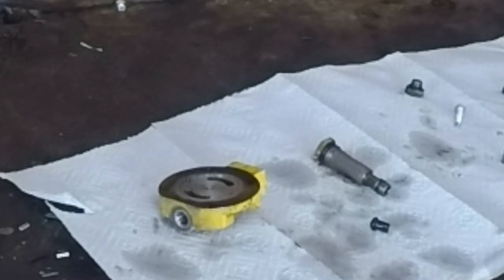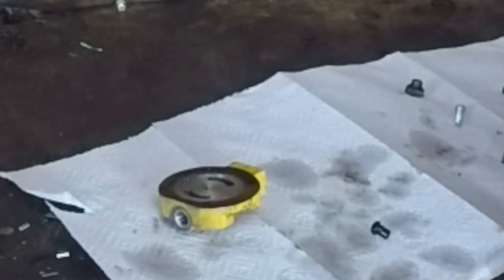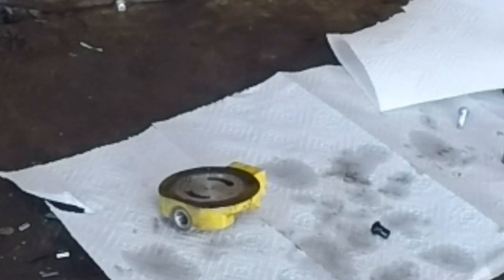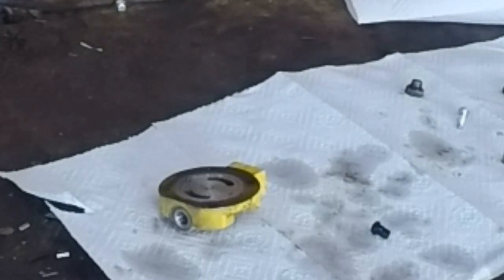Oh, well, darn it. I'm pretty sure I don't have one that will just fit this thing either. Boy, I sure would like to figure out a way to just test that, just to make sure the rest of the pump is okay. What if I put just a small piece of fuel line in here, just to simulate a spring, just to see if we can get the cavity to fill when you crank the engine? You know what I mean? Let me show you. I'm looking for a little piece of vacuum line. Oh, that's going to be perfect.